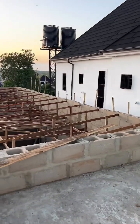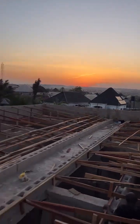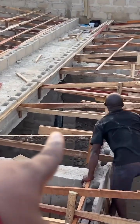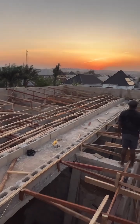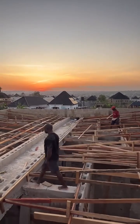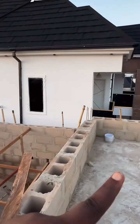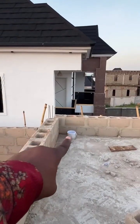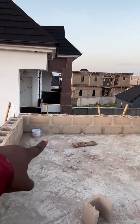We have a gutter running from the very beginning to the end. The pipes — the downspout — are six inches wide, which is just wide enough. We have four drain pipes across the whole gutter like this. We also have another one here. We are going to cut it to size, and we are still going to screed here to get it to drain properly.